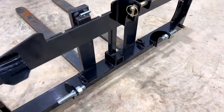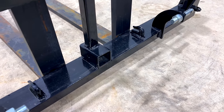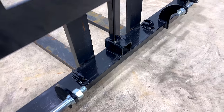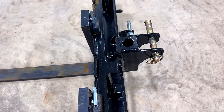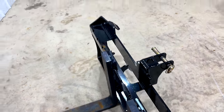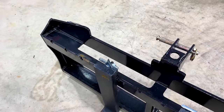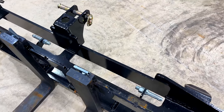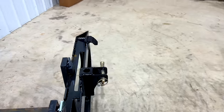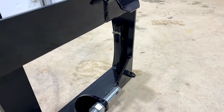The production model has the chain hooks mounted at 180 degrees with the built-in weight rail on top — quick-hitch compatible, category one three-point compatible. You can see some parking stands tucked into the sides and corners. When you want to hook up to your three-point, the three-point doesn't lower down to the ground, so you just deploy those parking stands with one pin — that way the three-point on the forks is up high enough to hook up to it. Pretty sweet product.